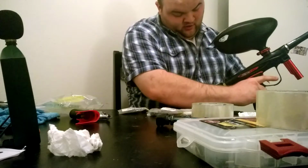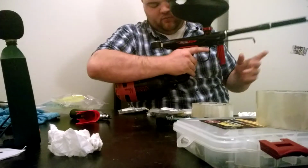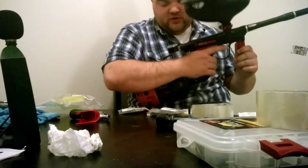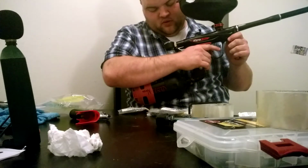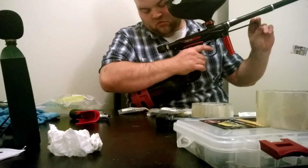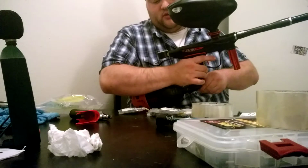So, gauge is in. All right, I moved it a smidge. I had a better gauge on the way, but it didn't show up. Well, it just showed up, but it didn't work very well. So, transducer says 51. Gauge says about that. Shooting it a bit puts it back down to 50. So, gauge says about 51, transducer says about 51, holding after shooting.